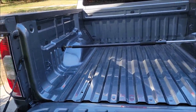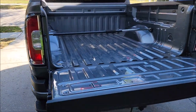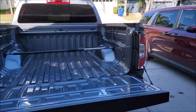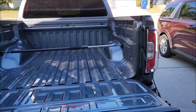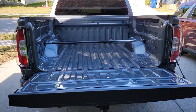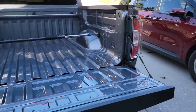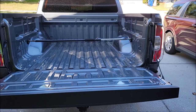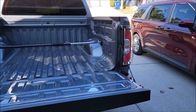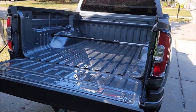I can coat skis, the underside of skis, the hull bottoms — we can do that mobile. I have an engine hoist and straps to lift the ski off the trailer so I can access the hull bottom. If you're looking at making your ski more durable, you're not going to lose any speed or aerodynamics. We can vary the amount of texture just by varying how far we spray from the surface as well as the pressure coming out of the compressor. I've been doing boat decks and all kinds of other cool stuff, and I'm really excited to get this angle of my business rolling.